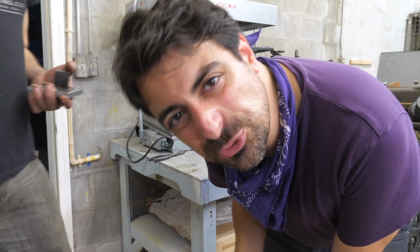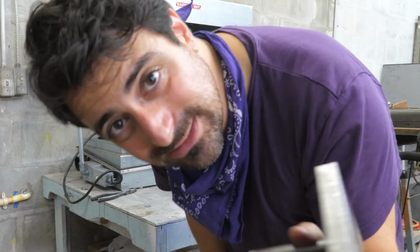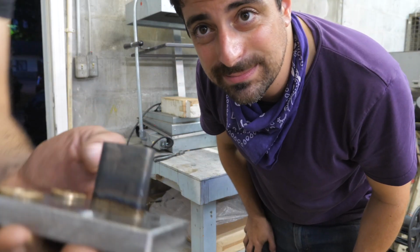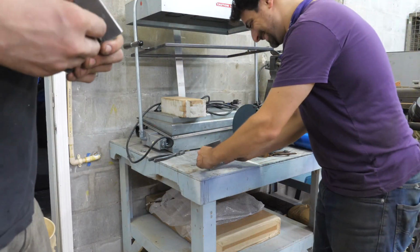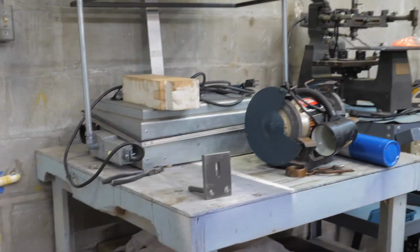We're doing the heat treating stage of the die. This section to be hardened so that it doesn't just fall apart. And the male section, which we already did. You can see it's nice and blue. Got hot, dipped in water. There's a bunch of ways to do it. We did it this way. Oil absorbs heat slower. Water cools it faster. We're not explaining it. We're just show and telling. And it gives it a different type of temper.